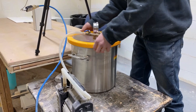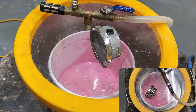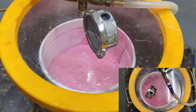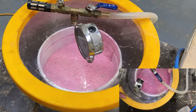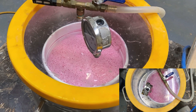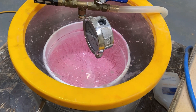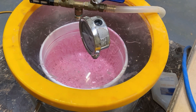He's putting it in the vacuum chamber. If you've never seen rubber boil under vacuum it's kind of neat — it looks spooky or scary, kind of nasty, but as the air is taken off you'll see it here. We're going to take all the air off and take the atmosphere out of it. When you take the air off silicone it expands considerably, so a rule of thumb is to only have your container about one-third full. You can get by having it fuller if you shake it because shaking makes it collapse faster and draws more air out.